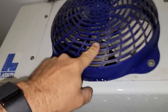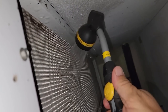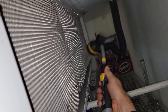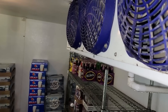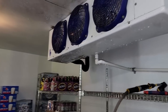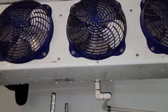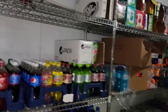I noticed this fan here slows to shut off, so we're going to replace that one. And I've already got one that's completely dead down there. We'll do a little rinse of the coil — you can see a little bit of dirt, but I don't think that was enough to slow airflow to cause what we've got going on here. I think we've got defrost issues. It was set for about 30 minutes total, and if they're trying to make this a beer cave style setup, that's not going to be long enough. Usually we need somewhere between 45 and 60 minutes of timed off defrost — meaning it just doesn't run the compressor section. We're going to pull a couple of these fan shrouds and get in behind there to make sure there's no ice hiding in the coils themselves.